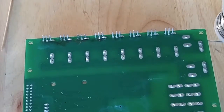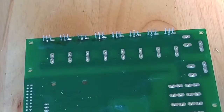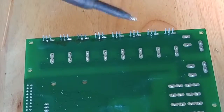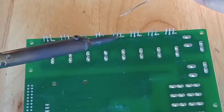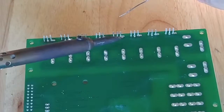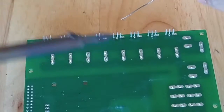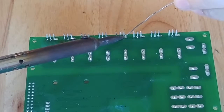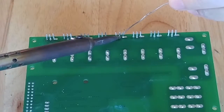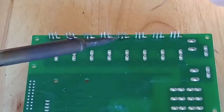Now what I'm going to do is solder these connections. I'll clean my tip, put a little solder on it — I know my tip is bad, so don't worry about that, it still heats good. I'm going to put the tip right at the edge of one of the contacts, make sure it touches the land, then heat the leg of the transistor for the AC controller and the circuit board. Put a little solder on there, make sure it gets good contact — just like that. Touch it to the land and the leg, put a little solder in — boom, they're done.